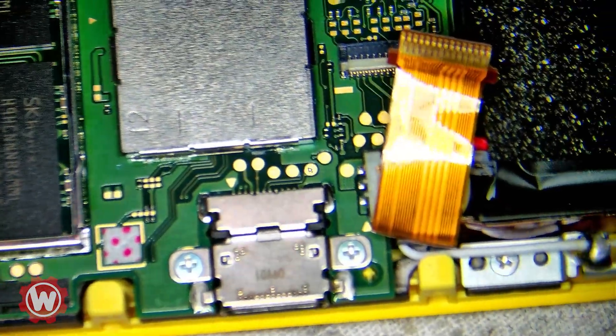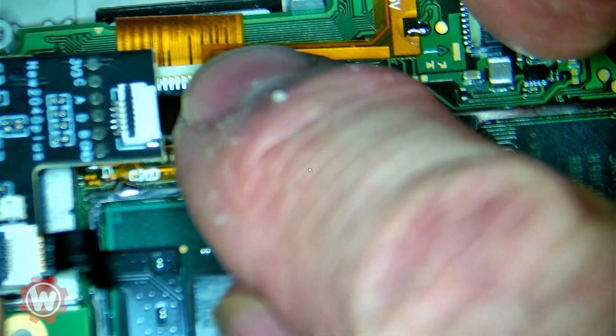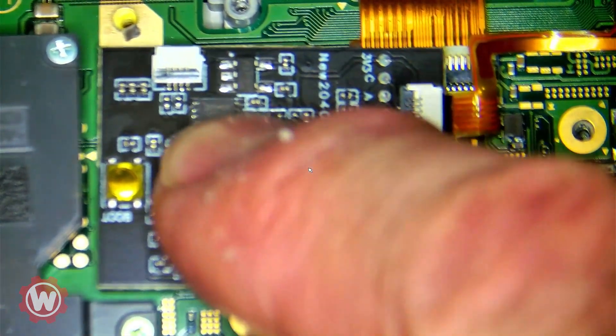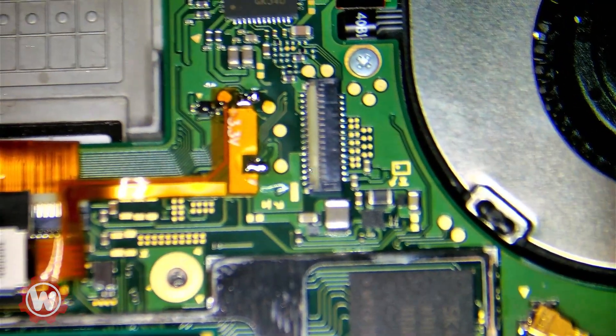Always make sure you have your device disconnected from the battery, or the battery disconnected from the motherboard. I'm getting some double-sided tape. We are going to be putting it right on the edge of that metal piece, because the cover goes right over it. Then this will go right here once I cut it, of course with the thermal paste. This is a pretty nice and clean install.